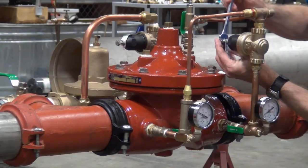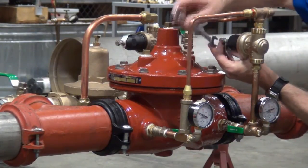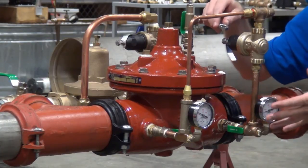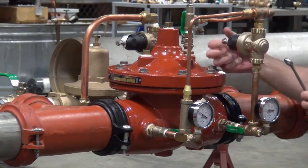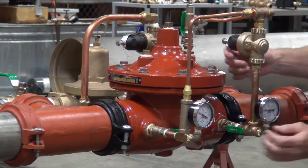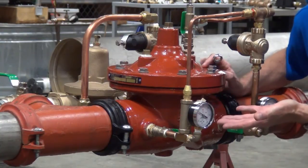That is the minimum continuous flow rate for a four-inch valve. When adjusting a pilot-operated PRV, we want to do it fairly slowly. As you can see, I'm giving the adjustment bolt a little bit of a turn, watching the gauge catch up, then giving it another little turn — ultimately creeping up on my desired flowing pressure. I've now raised the flowing pressure up to approximately 50 psi, backing down just a little bit as I stepped slightly over it. It is not uncommon for a pilot-operated PRV like this to have a lockup pressure approximately 5 psi higher than the flowing pressure — it takes a little more pressure to make the rubber bite into the seat and finally shut the valve off. That's very common and very close to what's expected with a pilot-operated PRV.